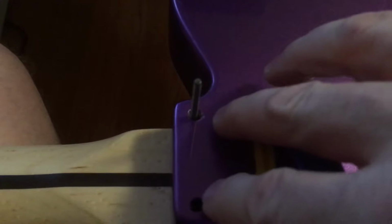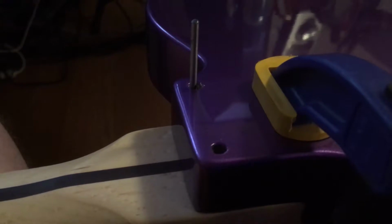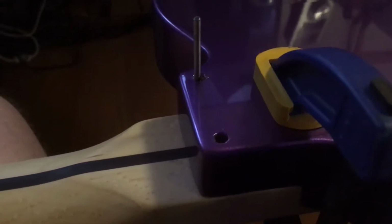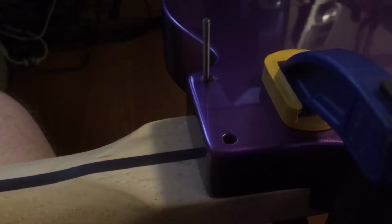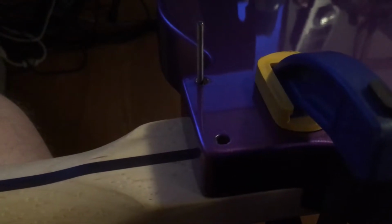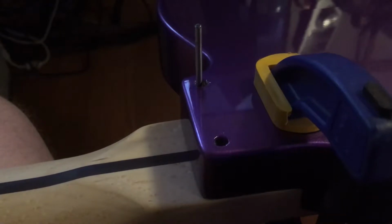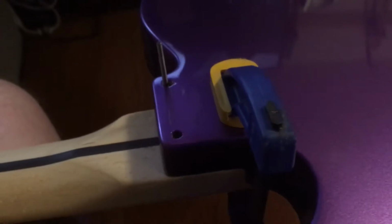I will need to put the neck plate on and then go through the body to see how deep into this neck I should be cutting. I should not be cutting terribly deep. I will not want to go the whole length of that drill bit, so I need to know physically with some sort of physical symbol. A lot of people just use a little masking tape, blue tape, something like that, that as the drill bit is going down, when the tape starts making contact with the body, as I read online, one person said as the tape starts sweeping away the shavings, you're done. So there is a little sort of eyeballness to all of this, but I think I can do it.